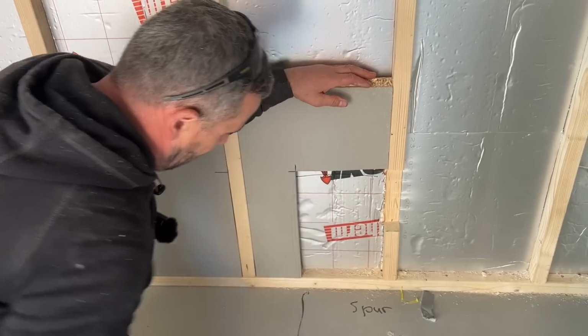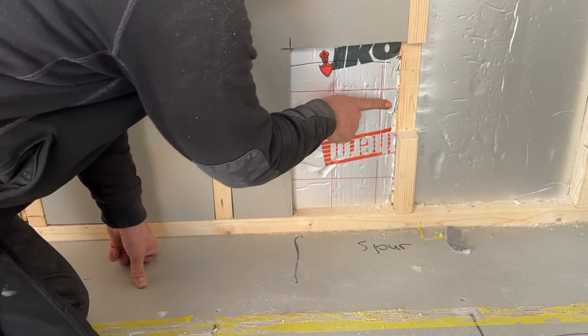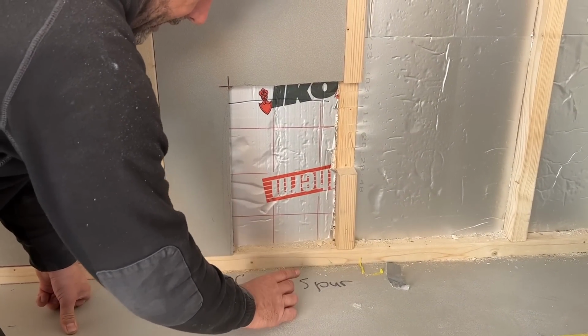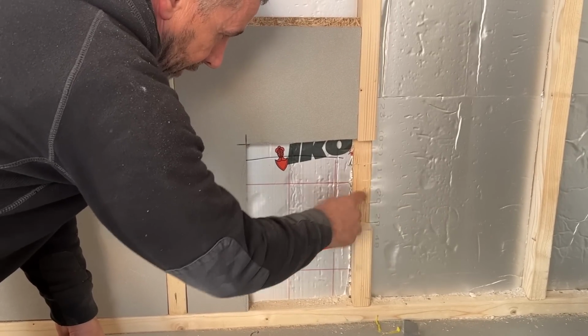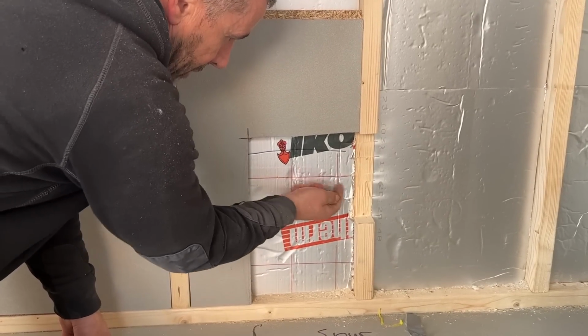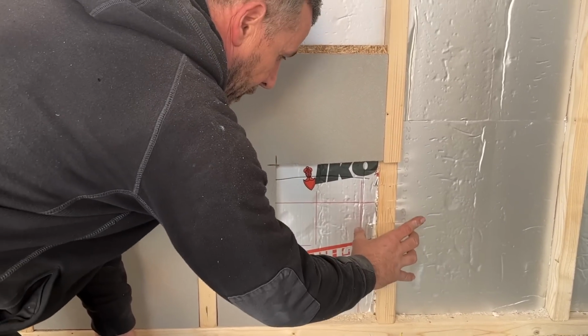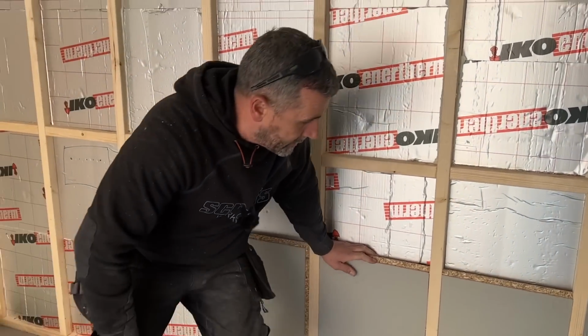The reason why we've cut that off there is because John will bring the cable for the heater in through the wall and into the back of the fuse spur. Now, we like to leave approximately 100 mil between heater and fuse spur, and the fuse spur is going to probably fall somewhere around there. That's why I've took that out there, and he'll thread the cable in through the back of that plasterboard box. So it's all concealed and it's tidy, so you've literally got a fuse spur there, no cable, heater, and that's the way we like to move forward with this. Keep it no cables, and keep it nice and tidy.